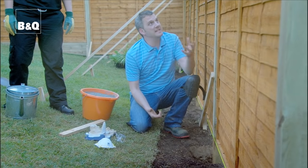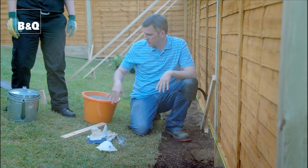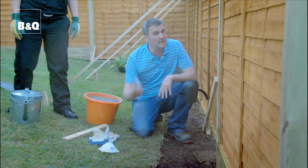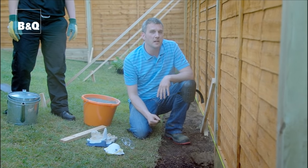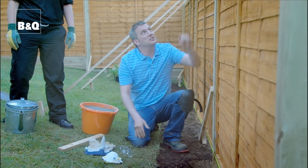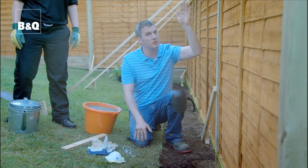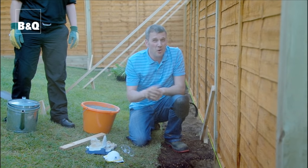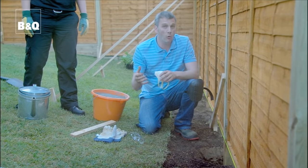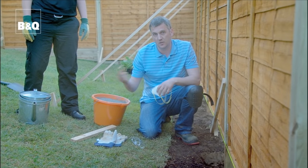Because Loretta and I can't stand here holding these posts for five hours or more, we're using rapid setting cement which will set in about five to ten minutes. It does kick up a lot of dust so you will need to use goggles and a face mask. But before you put the concrete in the hole, go round again to check that everything is okay — check that the posts are in line with the guidelines both top and bottom and the posts are upright, because once you put the concrete in there's no going back. Most post mixes are mixed in the hole, not on a mortar board.